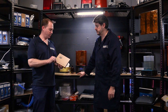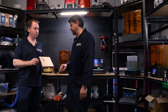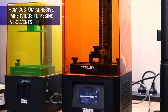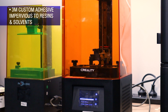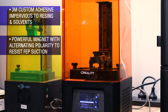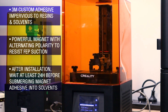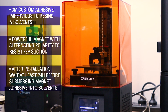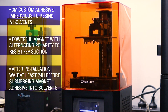This is the one for the resin printers. The main difference between this and the FDM version is that the magnet has two key variances. First, the glue used on the backing is much stronger and can prevent resin or other chemicals from causing that glue to come apart and the magnet to fall off the build plate. Second, the thickness of the magnet is a lot thicker than the FDM version to prevent that smaller piece of metal from slipping, moving, or being pulled off. In a resin printer you're pulling the model off between each layer away from the FEP sheet and that force is very strong, so the magnet has to be equally strong. Also, the bare metal doesn't require any PEX or PEI sheets stuck to it.